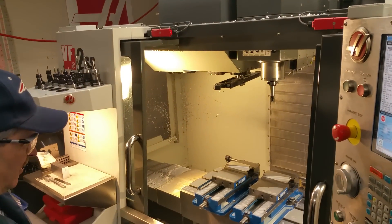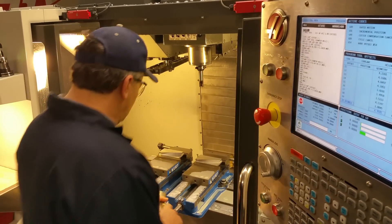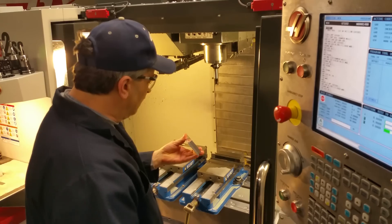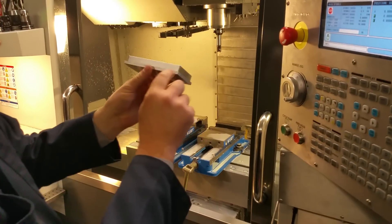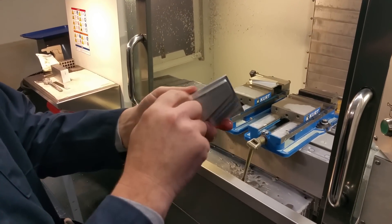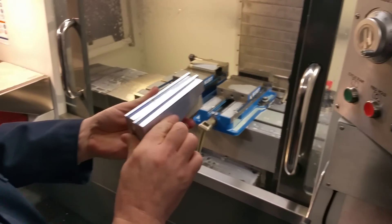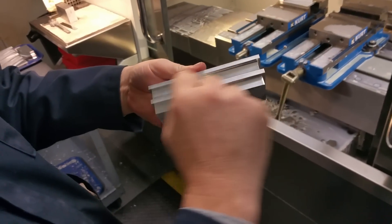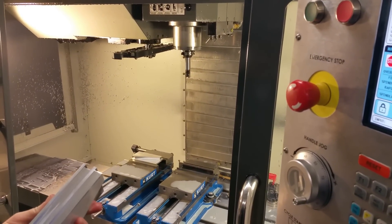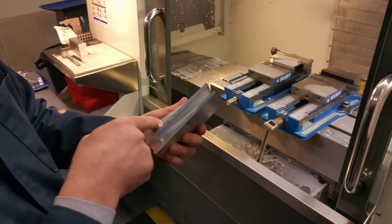That vibration I'm sure we can get rid of. Our cycle time was a minute 15 seconds. You can see there is well under a 125 finish. Is it something I would want to send to my customer? Absolutely not, even though that's all they call for. This is the two inch face mill cutter, this is the one inch cutter — but I've also got it sticking out almost four inches. I cut the length sticking out in half and I'm sure this roughness is going to go away. This right here is a little rough — we'll put this piece back in and touch that up afterwards.